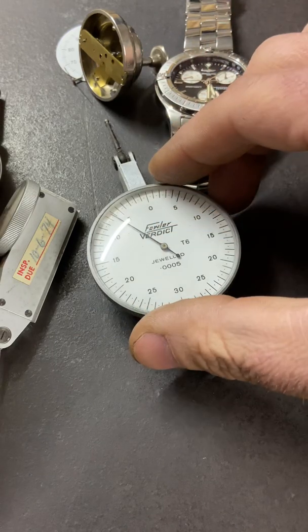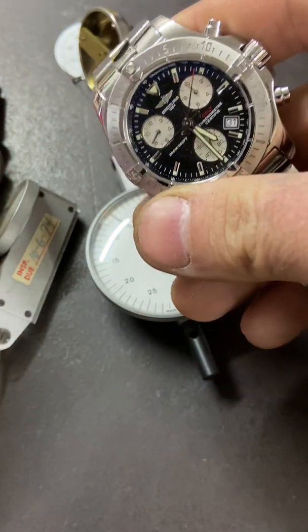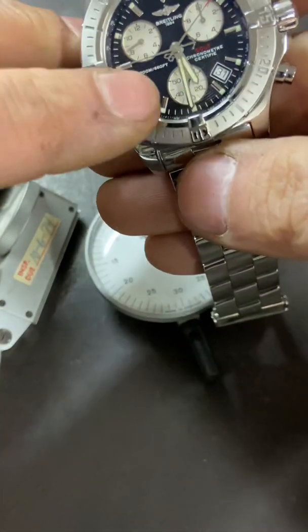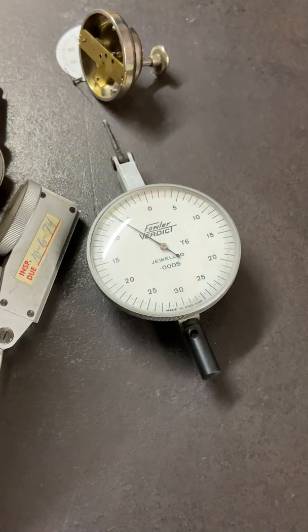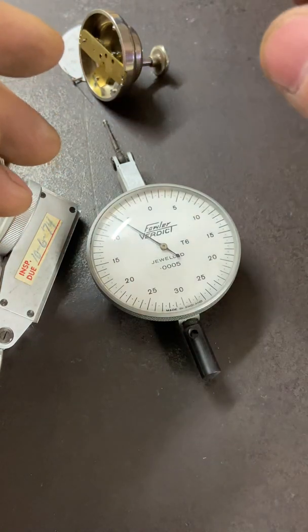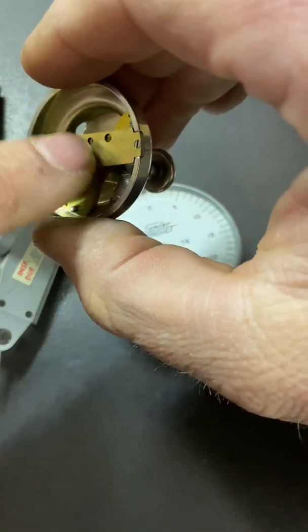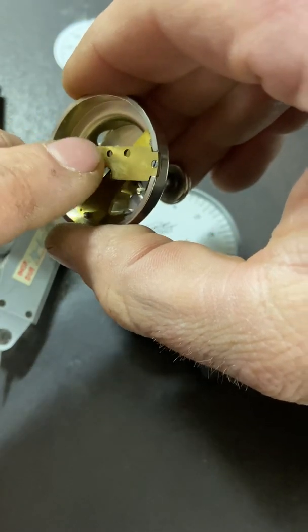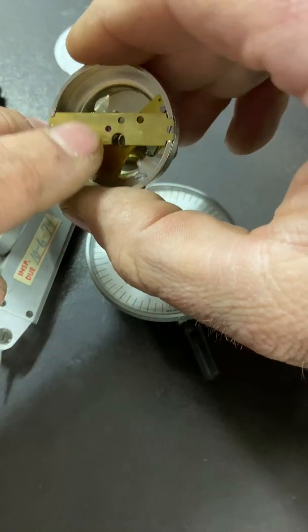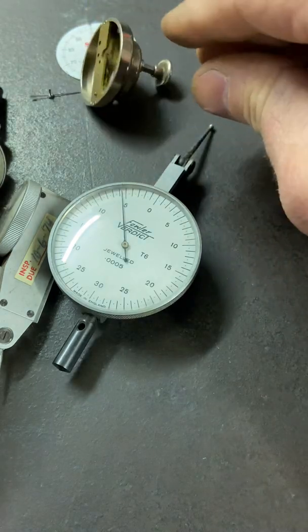That's my friend Danny Noon's — his dad was a watch repairman many many years ago. When you see old watches — new watches don't really advertise it as much anymore — they used to advertise it a lot: a 17-jewel watch, a 27-jewel watch, and that meant how accurate and how good it was. Before the 1930s they used to lap the gems in by hand, then they started machining both surfaces and dropping them in. So pocket watches before the 1930s are extremely expensive to repair because they have to be hand-lapped and fit each gem individually.